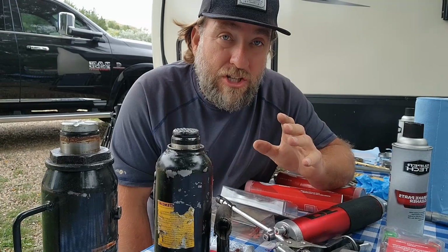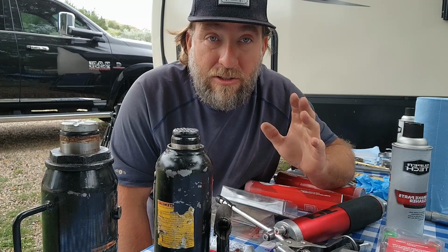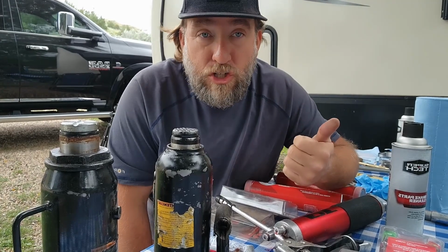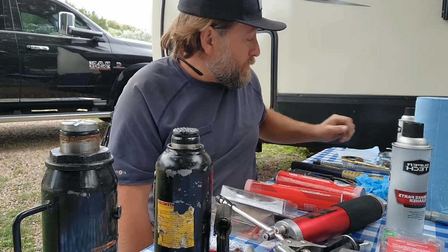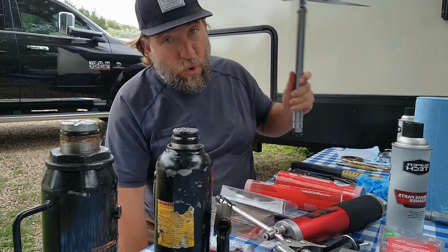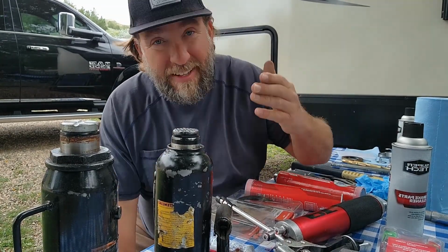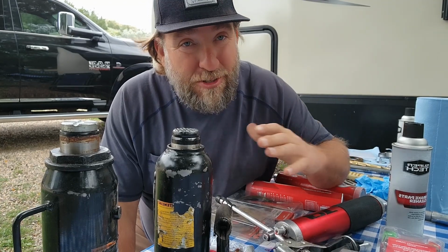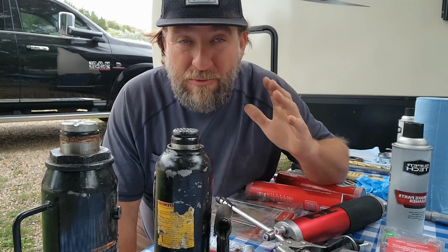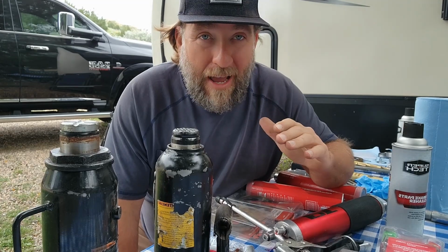Once you find that information out, you can go to YouTube, plug in how to do the maintenance on my axle, and I promise you, you're going to have a million videos come up to tell you how much torque you're supposed to have on your castle bolts. Remember your castle bolts, a torque wrench. Make sure you have the right socket for that. That's all going to be shared with you from the manufacturer's recommendations, but ours is Dexter. I've looked it up and checked what I have to do in order to do this.